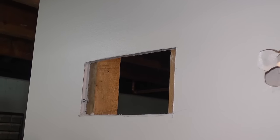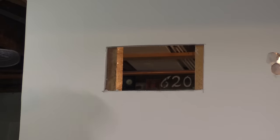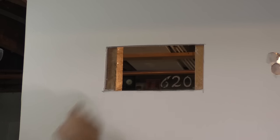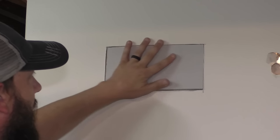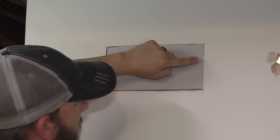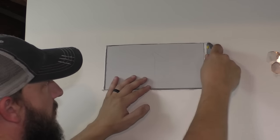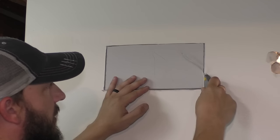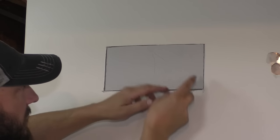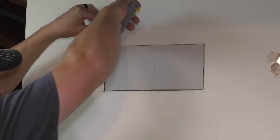Look at that. Studs. See, there's a screw right here. I can take that out. Now you just make sure this is clear, cleaned up, and see if our patch fits. Perfect. Something that I never really do, unless there's an edge like this where the paper is starting to kind of come out like this, is taper this right here. And it's not a bad idea. That way it makes sure that mud gets in here. You can do it to this piece and the wall if you wanted, but not a necessary step in my opinion.